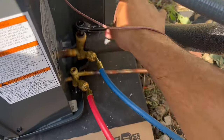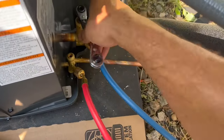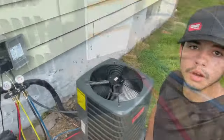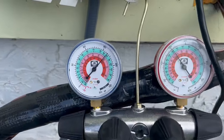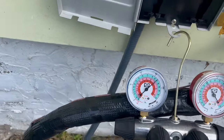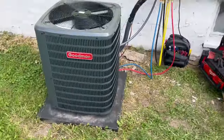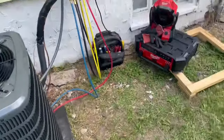It's not skyrocketing, it's going down actually — that's good. So I've opened my liquid line service valve first, now I'm opening my suction and we're gonna start it up. My phone's starting to overheat. Pressures are a little high but it's also 85 degrees in the house and 95 degrees outside. I like how it looks — I'm gonna go take a temp split and then we'll be out of here.